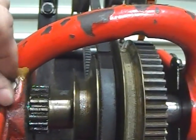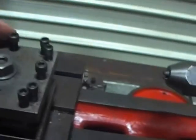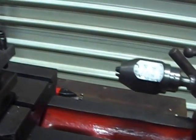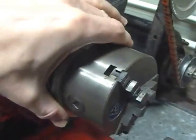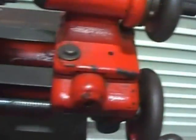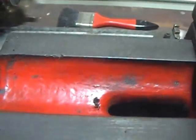I actually used to use oil in these - they just unscrew and I just used to feed oil through, then every so often pop some grease in there. Now, it's a used lathe, potentially up to 100 years old. There is play forward and back on the nut there - you would expect that. You always go the one way, and I never found that a problem - that's common for all lathes. A little bit of play sideways, very little actually - very little on the headstock bearings. I'm sure they're adjustable. That all feels tight, and you can move the lead screw one way or the other, and there doesn't seem to be a lot of discernible wear on the bed. There are a few little marks but generally it's not bad.